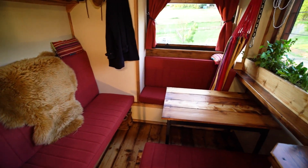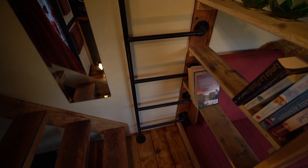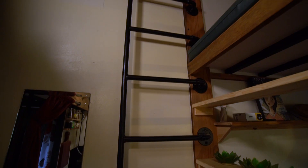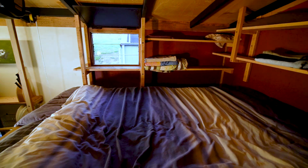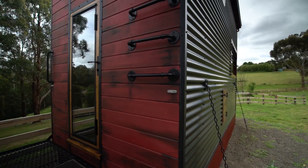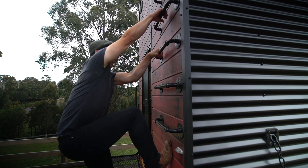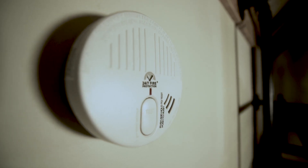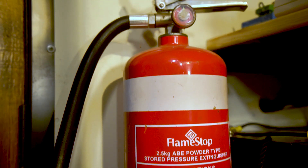I came from a background building playgrounds, so I was acutely aware of the safety of houses, and very worried that tiny houses were being built without even the basic hand grips required for stairs. I've installed vertical handrails next to the stairs, reduced the amount of stairs required, and installed appropriate hand grips. I've also put in some subtle features to prevent people from rolling out of bed, and included hand grips for the external stairs. The outside ladder starts one metre off the ground to prevent toddlers from climbing up it. I've also included fire safety methods — smoke alarms, fire blankets, and extinguishers are all here.